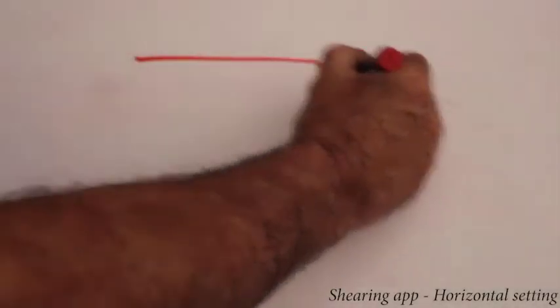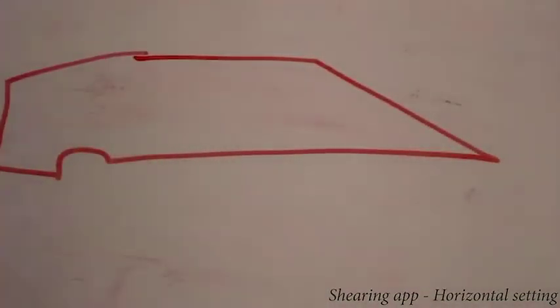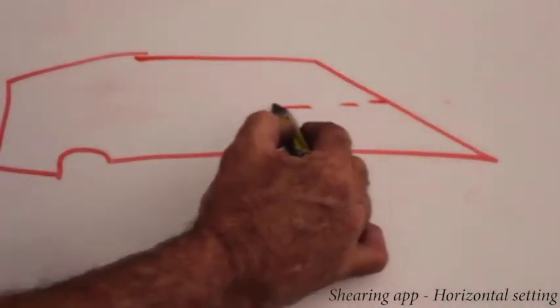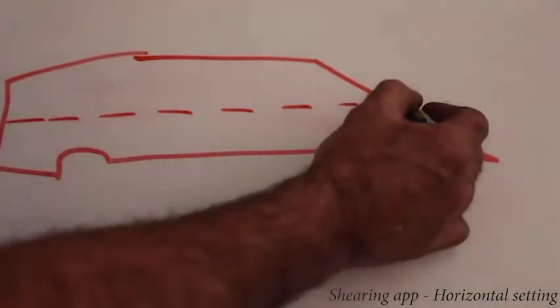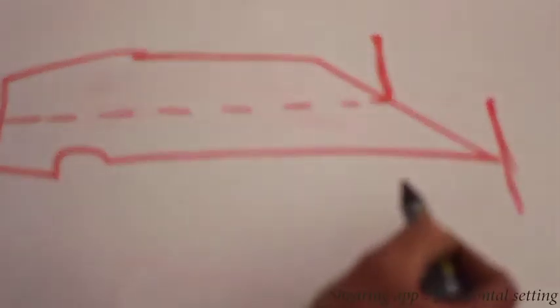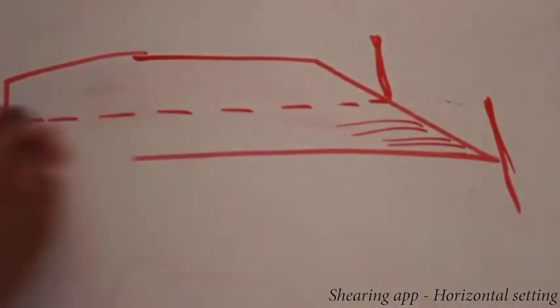And that's pretty obvious why cutters come down to the tip when they're thinner, because there's less steel above the pressure point line than below the pressure point line. When I get a new cutter, the cutter may be that long. But once that cutter's been ground down to half worn, then the cutter is only this long. When it was new, it started out as that long. The cutter's been ground down. Now it's half worn and it's humming.